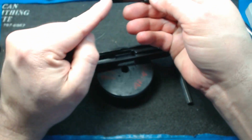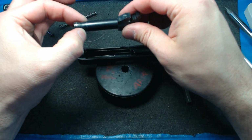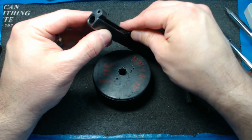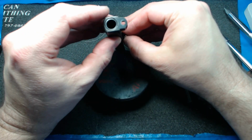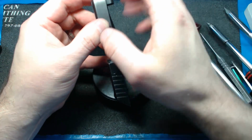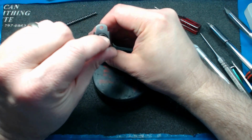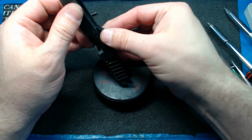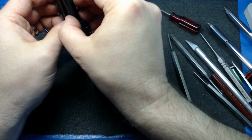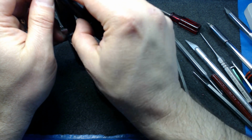One other note about the barrel is it's got this bell end, and that actually is kind of an important thing. If the barrel were a perfect cylinder all the way to the end, you wouldn't be able to take it out, because if it were a perfect cylinder and I went to rotate this to lift it out, now I've angled that cylinder. In order for that to work, this hole would have to be much larger, which means when it was closed, there would be wiggle room. This barrel would be flipping around in here. By using this bell-shaped end, that lets me rotate that barrel in the same amount of space. So while this is rotating, the actual diameter at the end of the slide doesn't change. As it's tipping in on this end, it's coming out on that end.